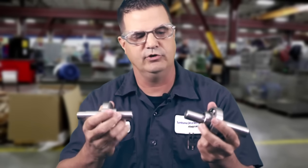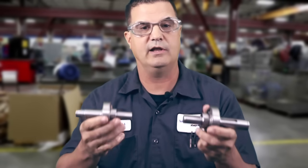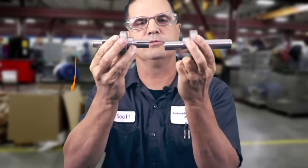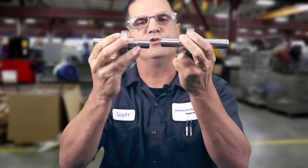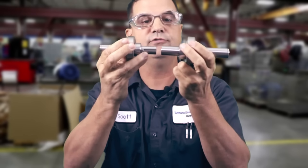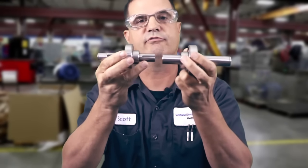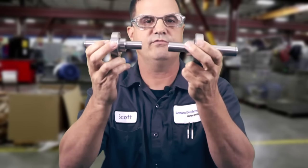We're going to give you a visual of the two types of misalignment that we see the most. First, parallel misalignment — you have two shafts, and if they're aligned properly they need to spin what we call collinear, spinning together on the same axis. Angular misalignment is when there's an angle away from the face of the shaft. That preloads the bearing and deflects the seal. The first thing you're going to see with excessive angular misalignment is typically a seal leak, and with a lot of angular misalignment you'll get a quick bearing failure.